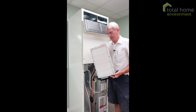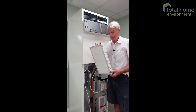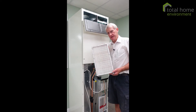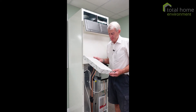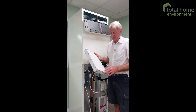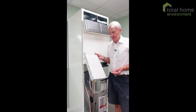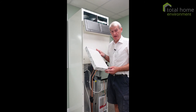So it's a good quality filter. They're used in hospitals and in lots of places where air quality is important. This filter should be changed at the very least annually, and if you have breathing issues you should change it more often. You can vacuum this off, but over time it will clog up, particularly if you're near a motorway or where there's a lot of diesel particulate in the atmosphere. It will stick into this filter and clog it and affect your air flows, so do bear that in mind.